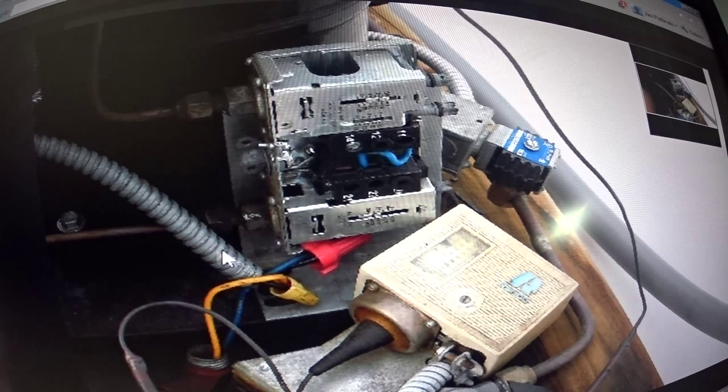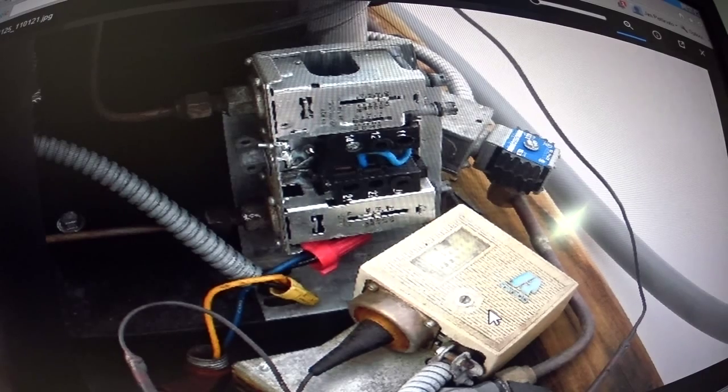And he took the electric line out of the BX connector here, and he just thimbled it, and he laid the control on the ground. And you got water splashing over here. And it's just not safe. And you can see this control, it had leaked at one time, and he spliced in a 1/4-inch tube there, but it's got some miles on it. And I guess because it's up on a roof, he didn't think the owner would ever know about it. He probably charged the owner for it too.